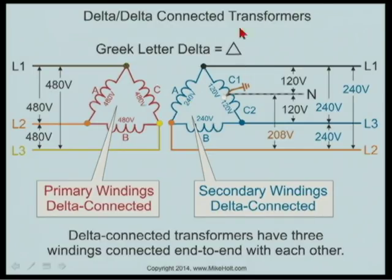Ratios are identified through the phases themselves, not the line. So phase-to-phase is 480. From line one to line two, 480 volts. This transformer here is 240 volts, but they've taken one center spot and run a wire off the center. If this transformer is 240 volts and you make a connection in the center, obviously half of 240 volts is 120, and the other half is also 120.